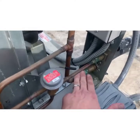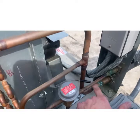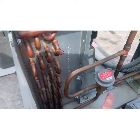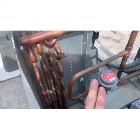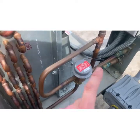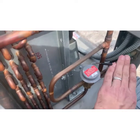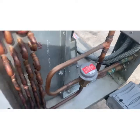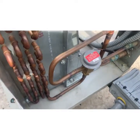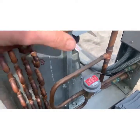The inlet line coming up is blazing — I can't touch it, it's 140 degrees. It runs up here and it's supposed to stop, but I'm pretty sure this valve is open because it's the same temperature as the inlet. The refrigerant running through my coil is all cold, so pressure isn't reaching here and we're not cooling the brine.